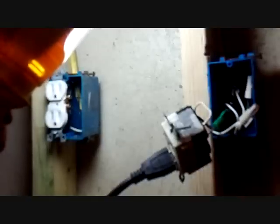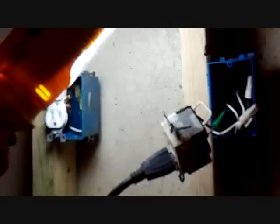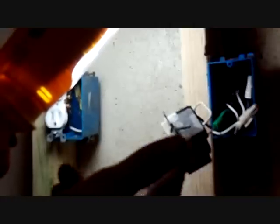I'm going to move this to the side so you can see something else I did here too. I actually took my two wires — my power wire coming in and my wire leaving out — and tied them together. Now, most of the time this is required by code. You can actually put both wires into the back of a receptacle, but by new building code, it's not meant for that. This is the way you're supposed to do it. It doesn't matter if you have a wire in and a wire out, or two, three, or four wires — you can do this. This is what's called a pigtail, so that you only have one wire coming to your receptacle.